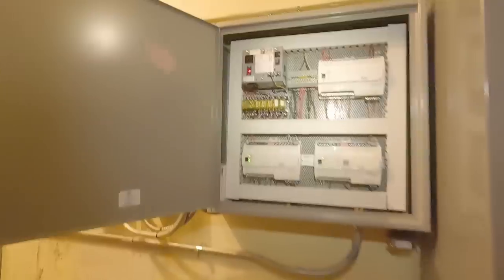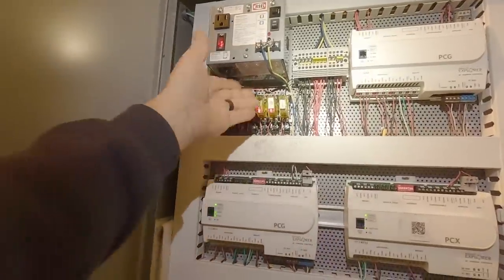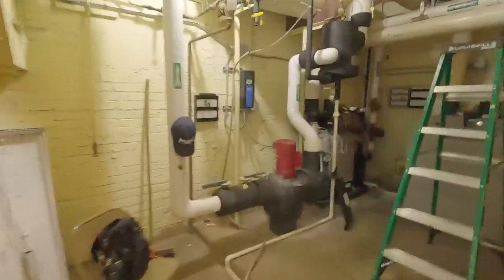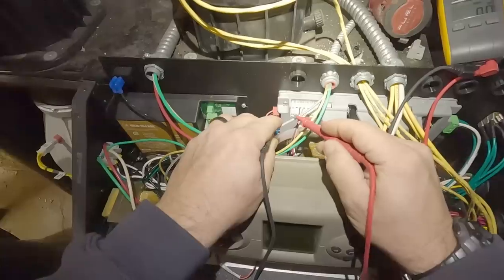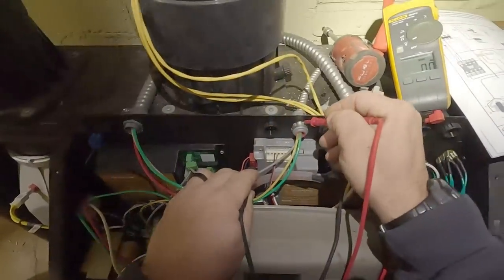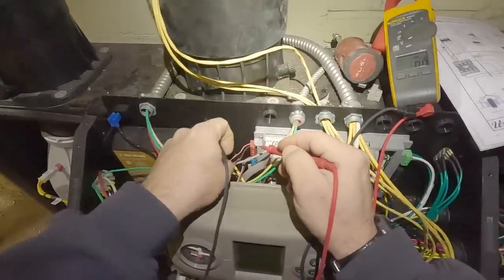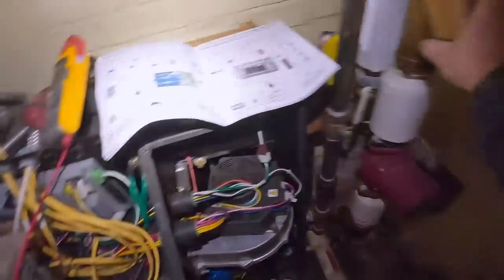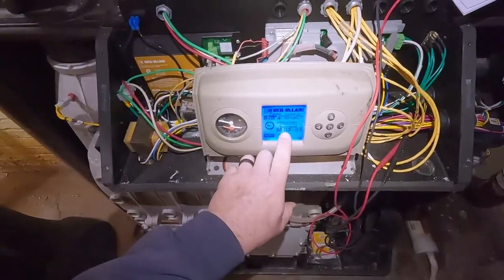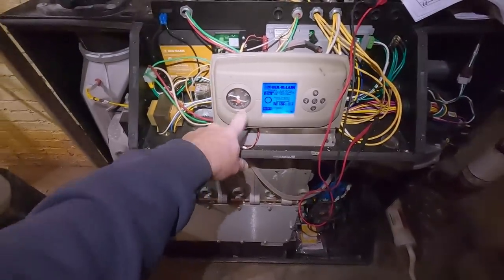Over here on our control system, I just got in and talked to the controls guy, figured out what my numbers were, made sure it was on and off. He ticked it on and off — it is the boiler right there, it's calling. Made sure we had voltage going to it. So I had a look at my book — terminal 16 here, and here is your thermostat call for heat. We're on AC volts — I gently got in here because I didn't want to move anything. We show no voltage to ground. We have voltage there — check the next terminal going up, we've got voltage there. So we are looping voltage back and forth — it should be calling. But when we come down to it, it doesn't say it's calling — it's in standby. Nothing's circulating. This boiler is 68 degrees — there's the boiler temp. System temp is 118. This is a shadow boiler — that's the politically correct term. Pressure switch is not inaccurate, not shut down on that. Outdoor temp is 43 degrees, so that temperature sensor seems to be working right. She's not calling for nothing, she's not locked out — that's what's kind of crazy here.